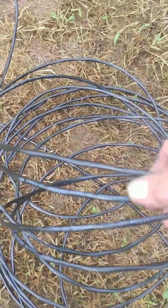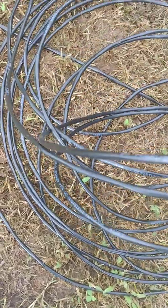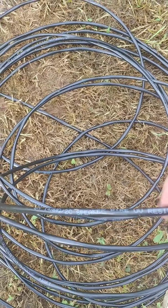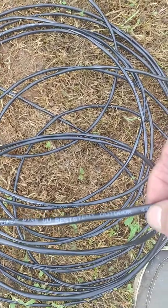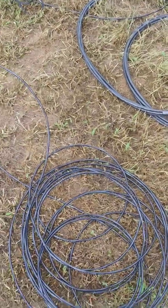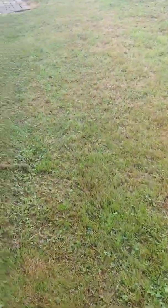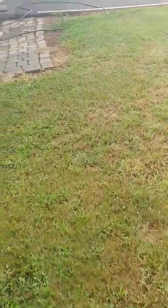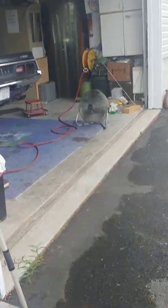One of the other side effects of this whole activity was I got this cable here, which is just fantastic. This wire is speaker wire — it's 14 gauge speaker wire. It's direct-burial rated, even marked with the footage, and it's got an overcoat on it that's just amazing. I mean, even kryptonite is not going to bother this stuff. I recommend it for anything you need to do outside. It's two wires, 14 gauge, copper-covered aluminum, made up of about 50 or 60 strands — very, very flexible.